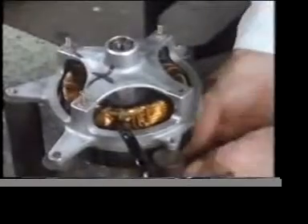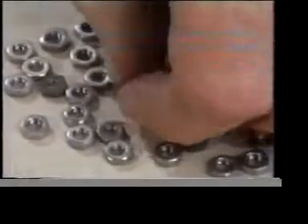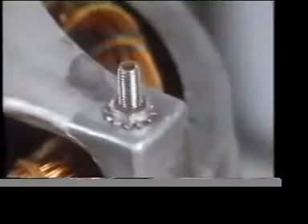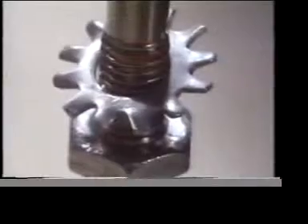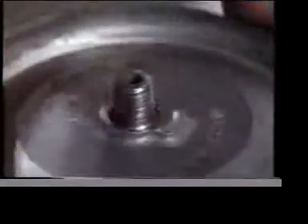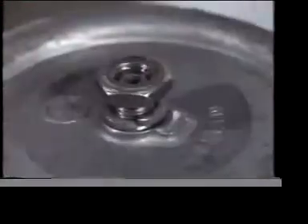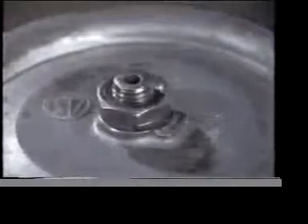The manufacturers don't really expect you to treat your washing machine quite like this. We've deliberately put an unbalanced load in to exaggerate the effect of the spin drying cycle — but you can't see any nuts flying off here. In this kind of light assembly work you can use a lock washer to keep the nut in place; this one increases friction between the assembly and the nut by means of teeth which bite into the two surfaces. If the joint has to take a heavier load, a spring washer is more effective.